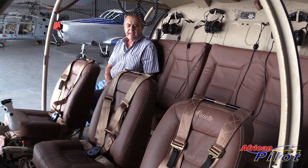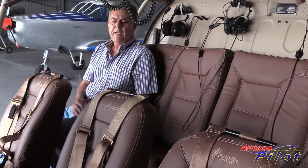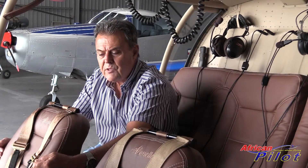The seats also had to be redone. They were rather rudimentary bits of sponge rubber covered by canvas. So we had the seats remoulded to be a little bit body-hugging to create more comfort and security. Getting the right depths and widths so you could sit comfortably was important. Of course the leather has to pass the flame-proof test, so all that had to be done by the authorised upholsterer. We also changed the seatbelts, which likewise had to be done by an authorised seatbelt supplier. There's quite a lot to comply with in terms of safety requirements.